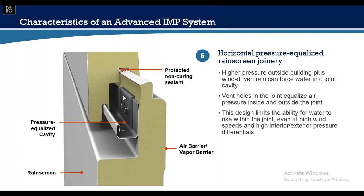The way to combat this is pressure-equalized joinery. A vent hole to the exterior equalizes the negative pressure between the exterior and interior. Think of it like a straw with a hole in it — if the hole is large enough, you can't draw liquid into your mouth because the pressure equalizes. That's exactly what this pressure-equalized joinery does. It's a belt-and-suspenders approach: even if installation isn't perfect, the pressure-equalization chamber prevents water from being drawn into the building.